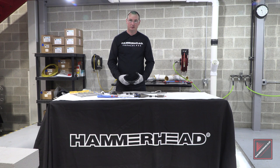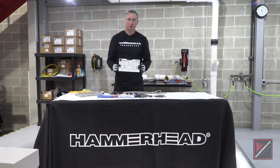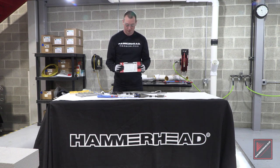Now we're going to start the assembly process. First thing you want to do is take out the reference card from the kit. On this card you'll see the individual components in the kit, where they are in the kit, and their part numbers for reordering if necessary. On the flip side we have a matrix — all you need to do is know your existing pipe diameter and the diameter of the pipe you'll be replacing it with. Once you know those two things, go down the right side, find the corresponding sizes, and moving left, find the part numbers for the correct components. At the bottom there's also a diagram of what the completed tooling string should look like.